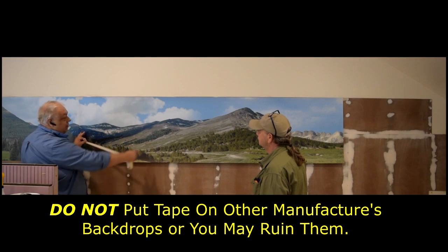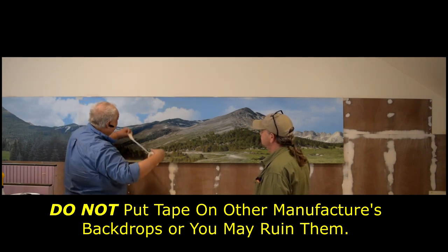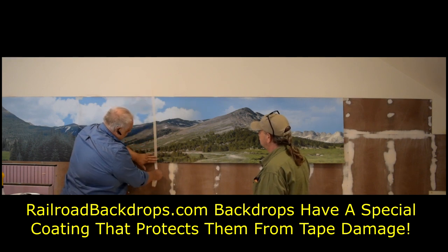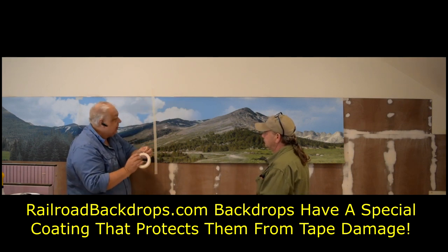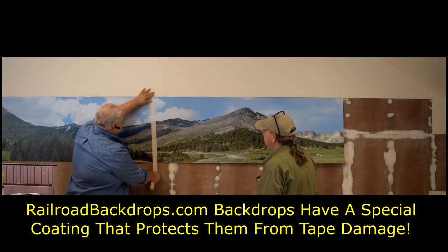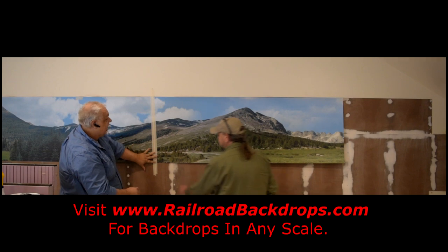Pick out a section that you feel comfortable with. Most people, it's about two to three feet that you'll be comfortable working with. Just put a masking tape — usually the yellow tape or the vanilla tape works better than the blue or green painter's tape. They usually don't have enough hold and have a tendency to start peeling off because it's such a low-tack tape.